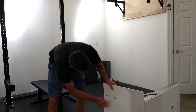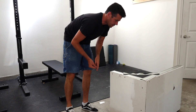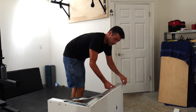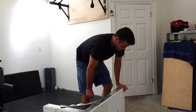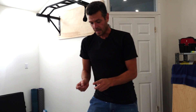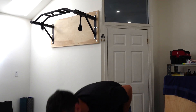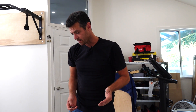I don't really know what else there is to say about screws. Basically, you can see how you can get away with using whatever screw, but long term — as we saw how it is not solid — you're probably going to get screw pops down the road. Just because you hung a job with the wrong type of screw and it didn't fail doesn't mean it won't fail down the road. For light gauge steel stud, we want fine thread screws. For heavy gauge steel stud, you're going to need the self-tapping screws. Hopefully this clarified at least a little bit of it. Thanks for watching Vancouver Carpenter — I hope you got something out of this video and until the next one.